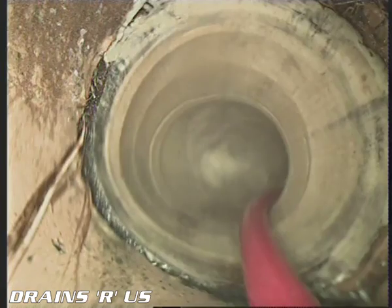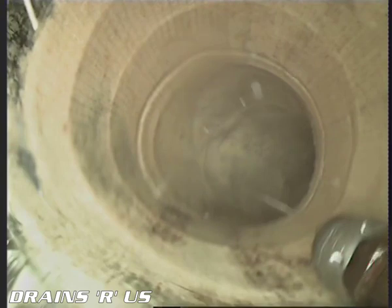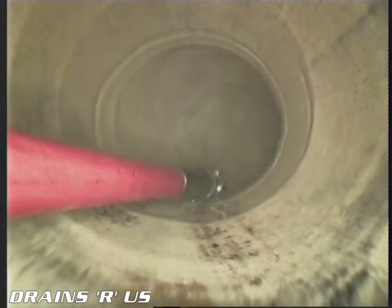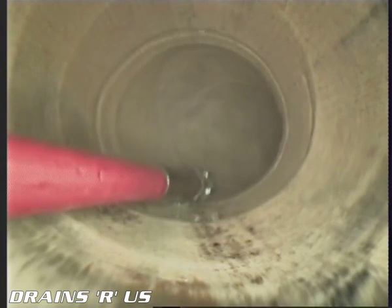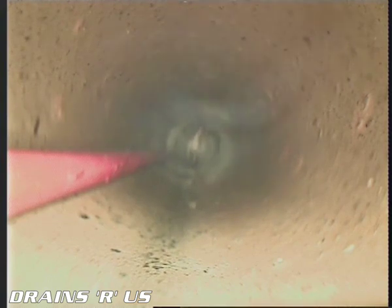I need to know where I've got to start - I don't want to run my root cutter inside the liner. I think I'm still going to need to take my root cutter to about there. You can see by all the roots that are down the bottom and at the top, that's going to take quite a bit of cleaning. I've still got to be able to get the sewer that I showed you on the first video. I'll start cleaning - I won't show you while I'm cleaning, I'm just going to get it clean and then I'll show you a clean pipe.